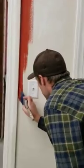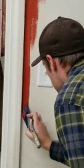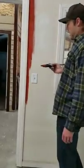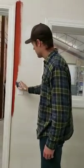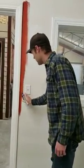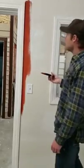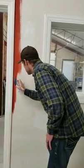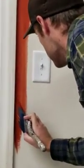Okay, so I'm going to get here, I'm going to find my line, I'm going to bend those bristles, and you just start painting along, until you run out of paint, and then you re-dip and go paint some more. So after we cut, we're going to roll the wall. I'm going to put a little bit of paint a little bit farther away from the trim, so the roller doesn't hit the trim. But in particular with painting lines, you want to really make sure that you draw out those lines really well by keeping your brush on the wall as long as you can.